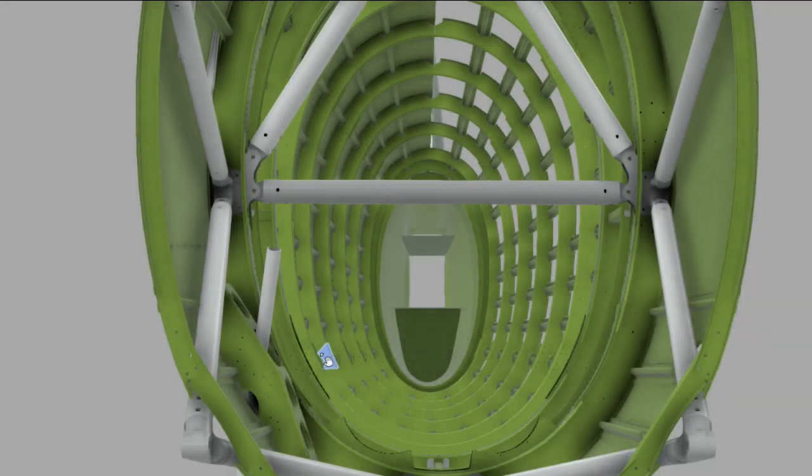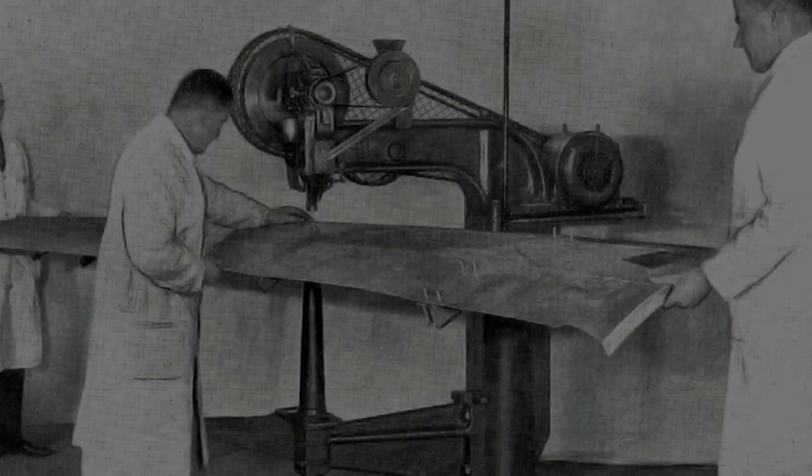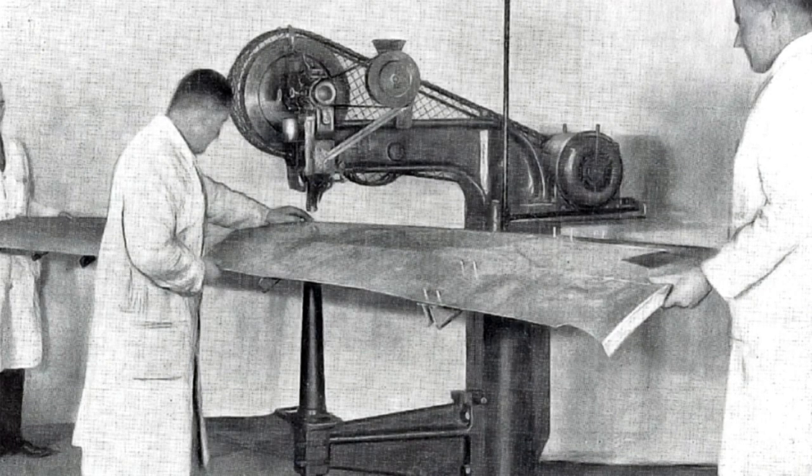When we look at the design of the forward monocoque section, every one of the frames, while a complete ovoid, has four splice points on it — this was for production efficiency. The monocoque on the Typhoon was built in four sections, completely skinned and manufactured with stringers and their rib segment on each section, built individually and then brought together on a final fixture. With JP 843 we're producing it exactly as they did structurally and design-wise, but that many people working also means that many different fixtures — it's just not the way to do a one-off aircraft. Perfect for production, not for a low-run build.